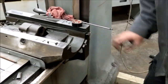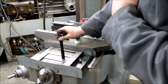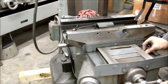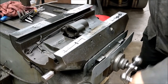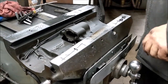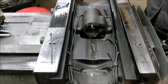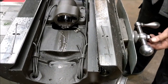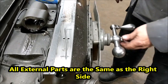Now we're back to mechanical. You're going to crank your saddle out to the far outside. If your machine has zerks you won't have any lube lines in here — we'll address those in a minute. Now we're going to take the end cap off the same way we did on the other axis — three-quarter inch. You'll notice this machine had accordion way covers, and this particular set took the top two bolts out and went with hex heads.